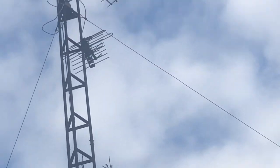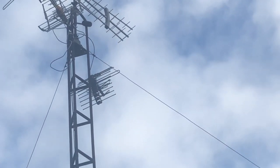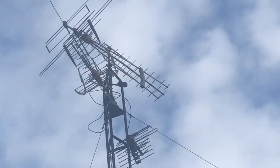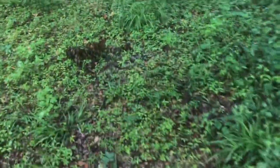This setup with a little fine-tuning is probably hitting 95-plus percent of the mark for me, but I'm missing one crucial channel that I may or may not get at 40 feet in the air. At 80 feet in the air on antenna tower 2, I'm pretty sure I can get everything I want. I've been scanning over the last 24 hours and getting hints of some of the low-power stations that'll probably never be stable on the 40-foot tower, but we might bring in 10-15-20 extra channels that are mostly stable at 80 feet.